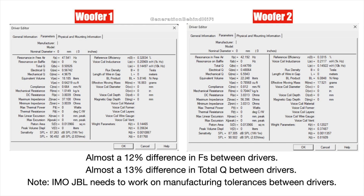I think a lot of these differences in parameters, especially in FS, can be attributed to JBL having very loose manufacturing tolerances for these drivers. I'm speculating here, but I think a lot of it has to do with CMS and MMS. CMS is a measure of suspension compliance — a driver with a stiff cone suspension will have a low CMS, and a loose cone suspension will have a higher CMS. CMS between each driver has a difference of over 20%. MMS deals with total moving mass, including the total weight of the cone assembly and radiation mass. Maybe some assembly workers are applying more glue on the cone versus others, causing the large differences. Again, I'm speculating, but I'm a bit disappointed that JBL has set the tolerances so loose, because other speakers in this price range have much tighter tolerances.